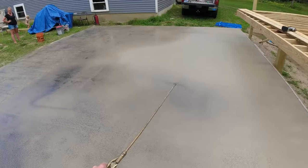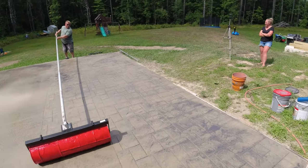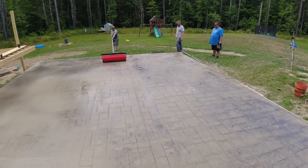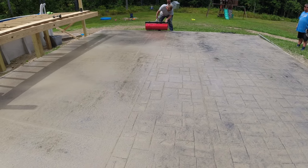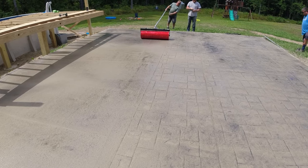Sometimes we'll just go plain clear liquid release and come back and teak wash it the next day to add that antiquing color — and we could do that here too. You can see how mixing the release right into the clear liquid works pretty well. It was about 30 feet that Luke was pushing the roller stamp across, trying to keep it perfectly straight. He did a pretty good job controlling it by moving the handles back and forth to keep the edge of the roller in the previous edge without making a double line.